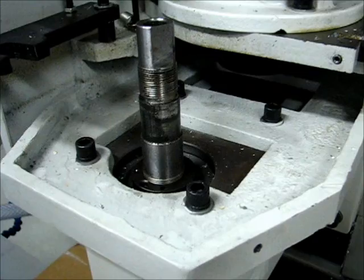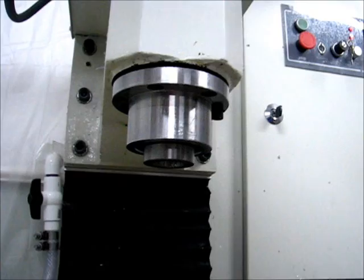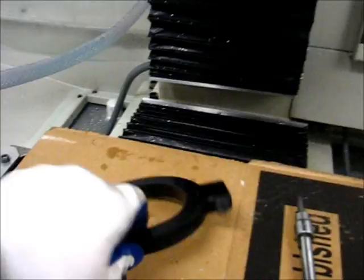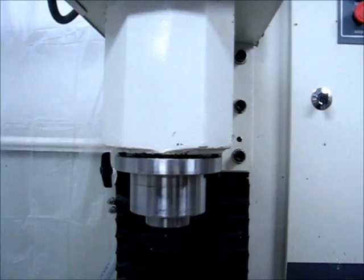All right, the cartridge is coming out pretty easily. One of the things you'll notice if you're a Tormach Duality lathe owner is that the quick change tool post mount, which I've got right here, which mounts in this orientation on the spindle nose, has to be removed. So after you spend a bunch of time aligning that, you will have to realign it later. But it comes out easily. In other words, it's not press fit into the housing or anything. Into the casting. Not terribly surprising, I suppose.